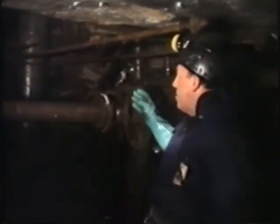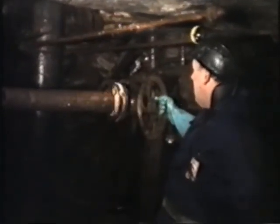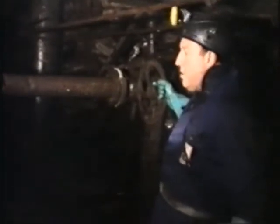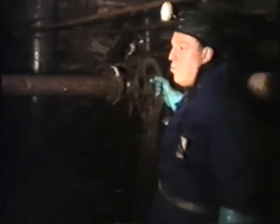We're looking now back at the bottom of Brewery Shaft. Here we see some of the control valve for controlling the flow of the water from the bottom of the shaft, or from the large tank previously mentioned, into the Pelton wheel system, of which there were two, and one Pelton wheel driven electrical generator. You can see at the bottom here all the stagings down the shaft have collapsed and filled the bottom of the shaft completely.